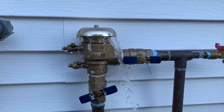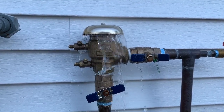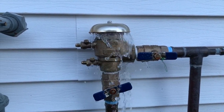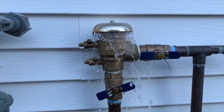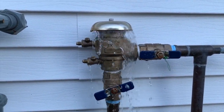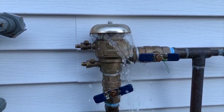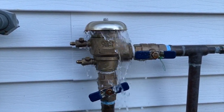Hi, my name is Mike Shepard with Shepard's Lawn Sprinkling, and this is a common problem that we find with homeowners: why is my vacuum breaker not seating, or as a lot of homeowners call it, chugging? What it's doing is the poppet and bonnet inside this backflow device is not sealing. Here are a couple tips on how to get it to seal.